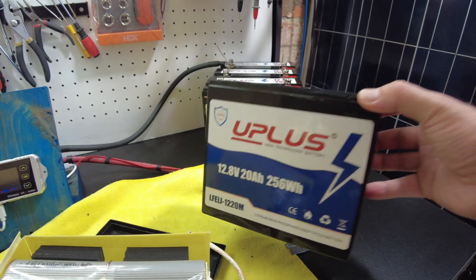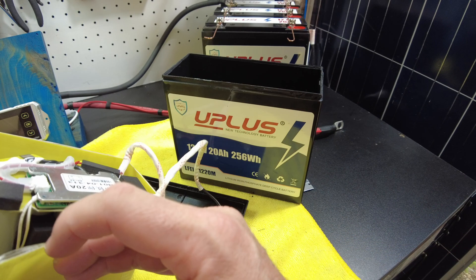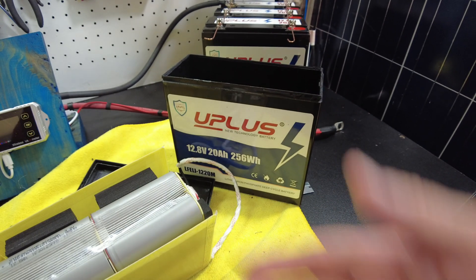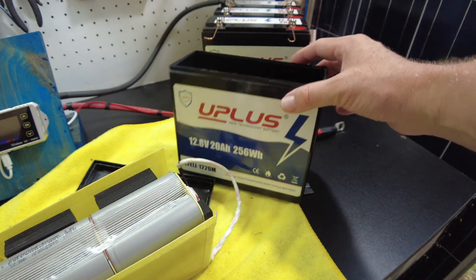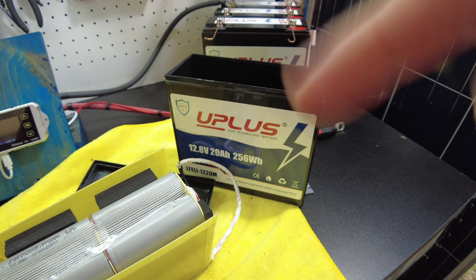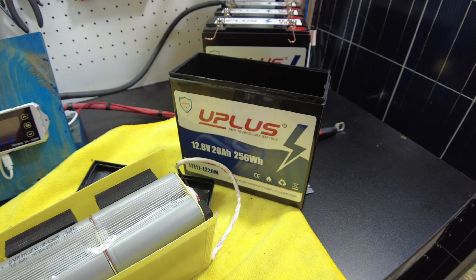So I think that's going to be the end of the video. I did not find a temperature probe in here — just a high temperature sensor, a high temperature switch. I do think the build quality is pretty good and the capacity test comes out great, so I like this battery. If you're looking for this kind of small size battery, this one seems pretty good. It does not have low temperature protection, but you can enable that in most charge controllers these days. I'll catch you on the next one.